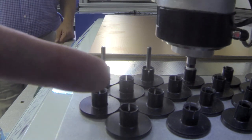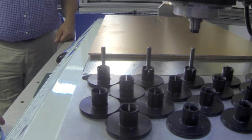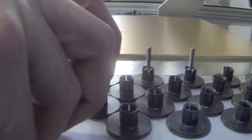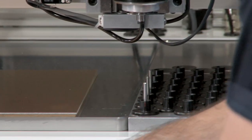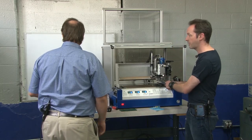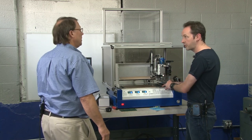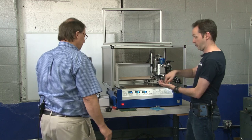And you can see it — it's a press fit down in there. There's nothing here that grabs it. When it goes in, the machine just pushes it in like this and it clicks in. There's little fingers and it just grabs it. So if you have to, you can take a tool out, but don't put one in there without the machine knowing it's there, because the machine doesn't know there's a tool in there unless it put the tool in there. You can get a collision and do bad things.